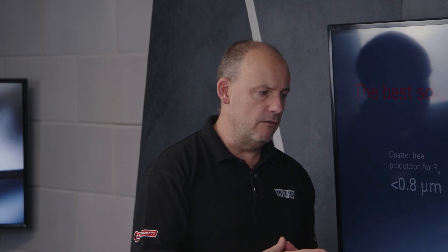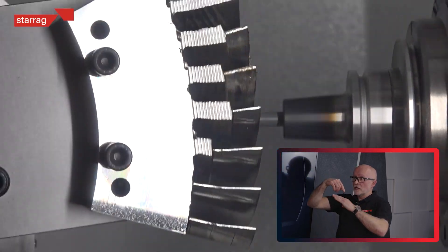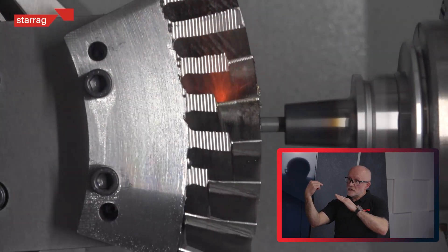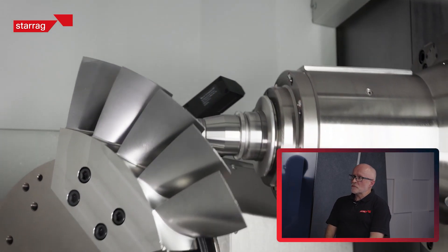We've also learned during our various episodes how you machine a blade. How do you machine and make a blisk? It's the same strategy in that you need to machine around a complex aerofoil shape, but instead of machining over, you've effectively got to come in from the end — tip entry, as we call it. If the blade is very long you have to come in from the side from both sides and blend the blade down the length. Fundamentally, blisks tend to be fairly short-bladed and you use a tip entry approach.